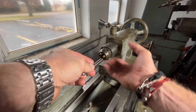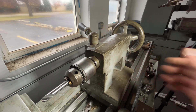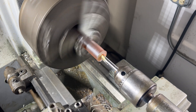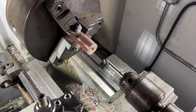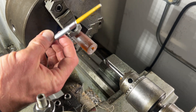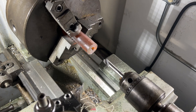Let's get this spot drill loaded up. Put a nice big chamfer on there to lead my drill. So now we're going to drill for the tang, and this is the file that we're going to make the handle for. Real fine cut — I use it for fine, low pressure work. So the tang is square. I got a drill that's about the same diameter as that tang cross corners. That's what we're going to drill it with.